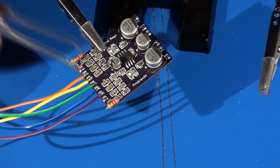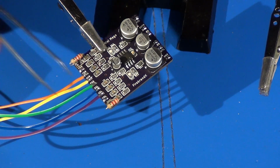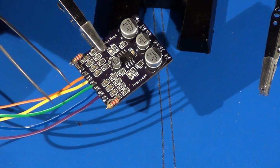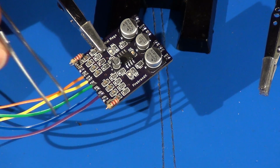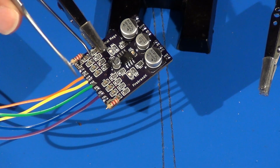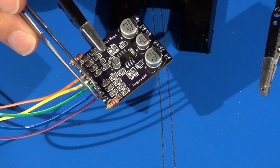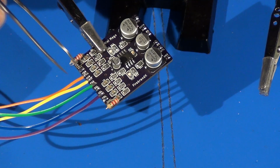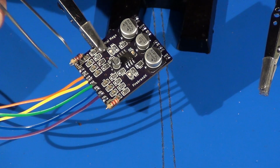Okay, so I've just completed the soldering of the initial input wires that I need. Of course, you can use any color combination you want, or you can use them all as the same color. It's really entirely up to you. I just happen to use the same colors that are in the initial instructions, which in this case is this purple, this blue, green, yellow, and orange. The two additional wires that would normally be attached would be over here to the far sides, and that is for the input right and left off of the FM channel, or the FM synthesis chips.